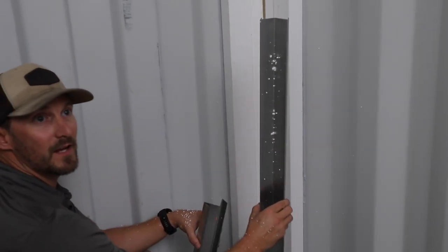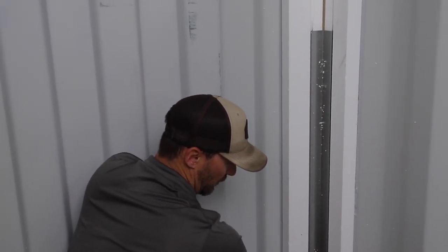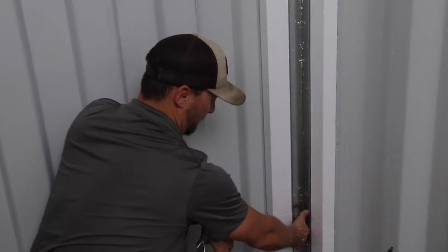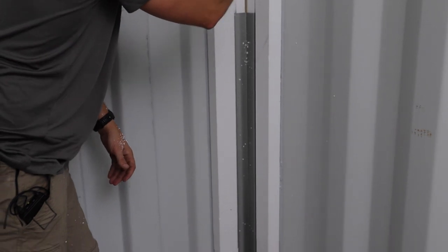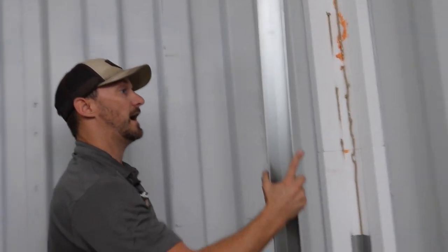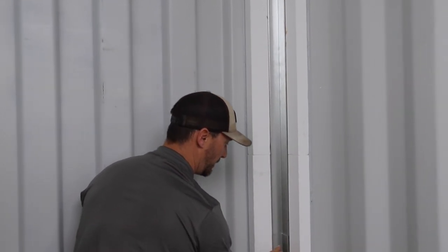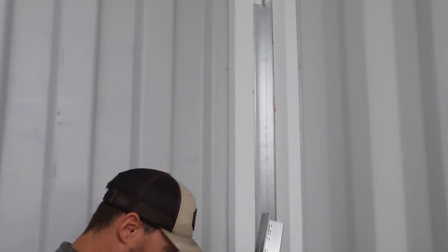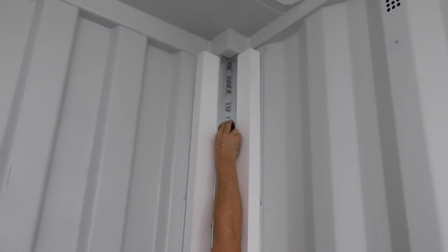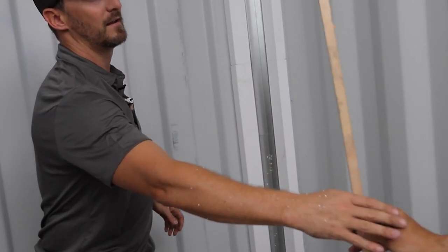What do you think about putting this piece in — big one first? And that's going to lock those two different pieces together, so you're always staggering your joints when you can. That piece is going to tie these two pieces together and ensures we have a nice even seal there. Then the other big one — we're going to put that right in there. Nice, good bond. I want to make sure this is pretty flushed up there so I don't have a weird seam. I want to make sure it's sitting exactly the way we want it. I got it — used my Inso stick. The Inso stick has Inso foam on it.